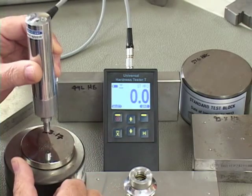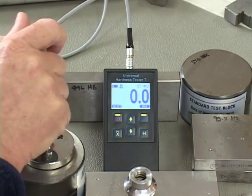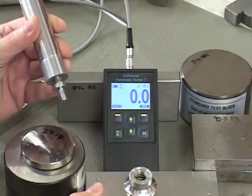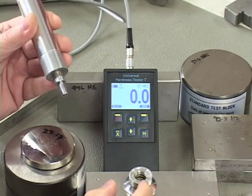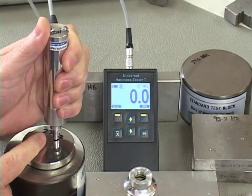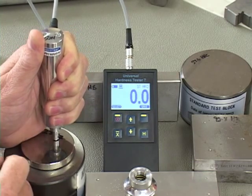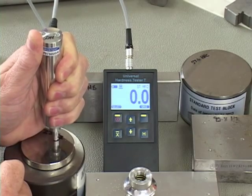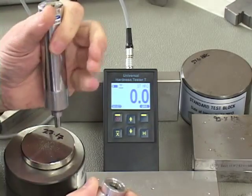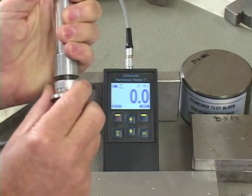What you've got to do is put the probe on the part and immediately press down to give the accurate value. There's nothing displayed because I haven't got this calibrated, so it's a two-step process. When you press down, you have to complete the press so that the face of the puck is bottoming out on the part being tested. With the puck attached you can see there is 12.5 pounds of force — there is some effort required to apply that load.